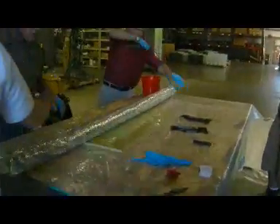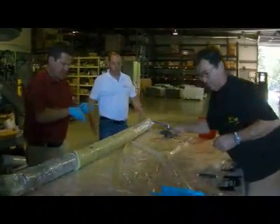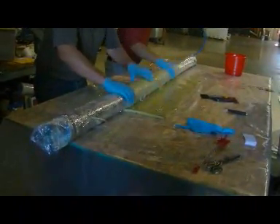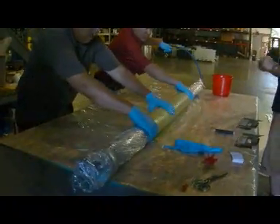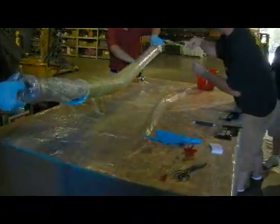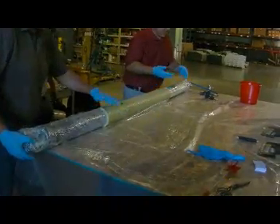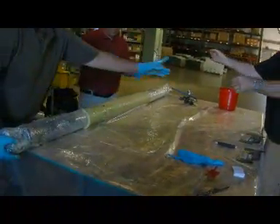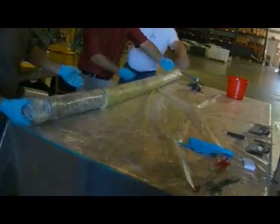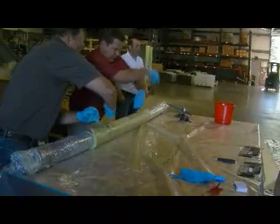Position it a little bit this way. Fold this little flap over. Roll it, but make sure it's nice and tight, not baggy. Lift the packet up a bit, make sure it's nice and smooth. Put the binding wire underneath, lift one end — about half a meter from the end to hold the end plate. Pull it tight, twist it three or four times. That's actually three layers — because of the overlap, all the material expands.